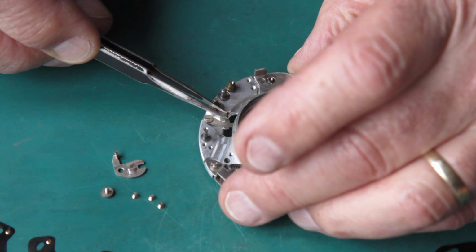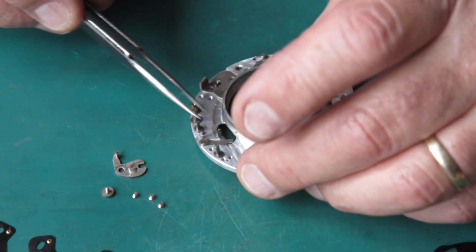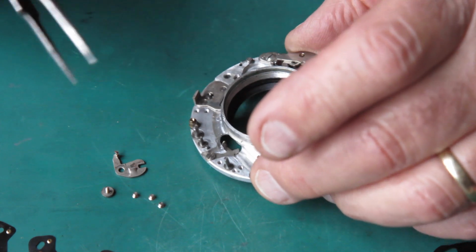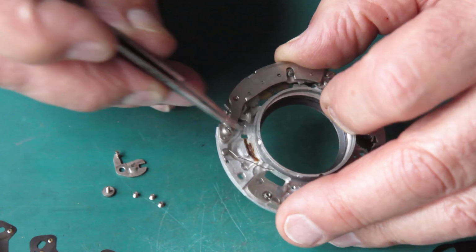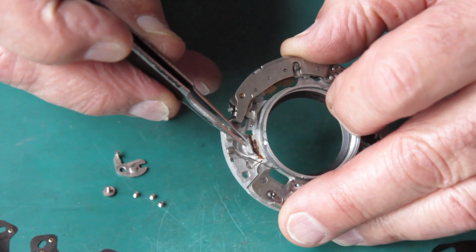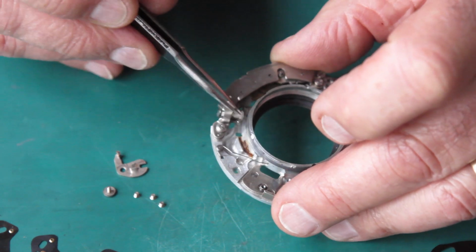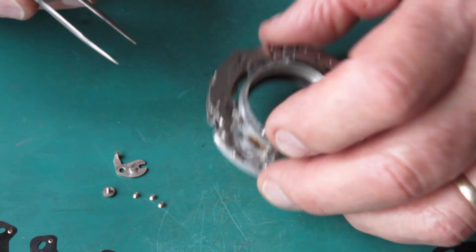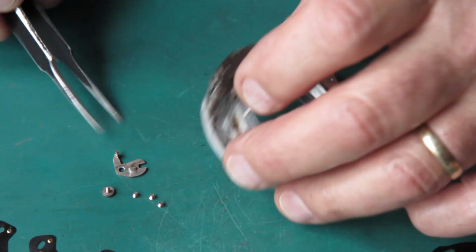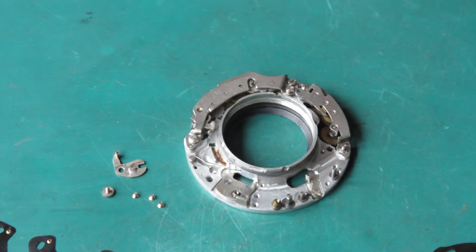This little lever here opens the shutter blades in the B or T position. Generally speaking, you don't need to remove that from the plate. And you can probably see some very dirty brown grease there, complete with all the dust it's gathered up, which will need to be removed and cleaned, so that everything's going to move smoothly. So these parts all have to be cleaned with naphtha, and once they're all cleaned and ready to go,